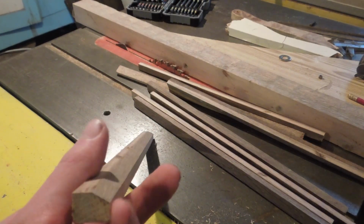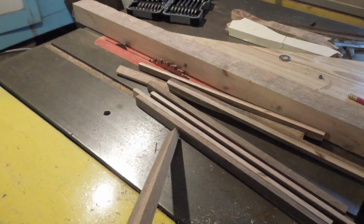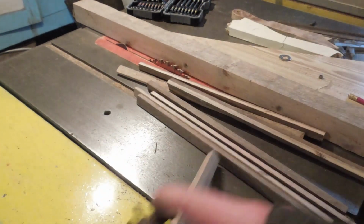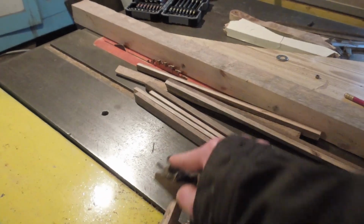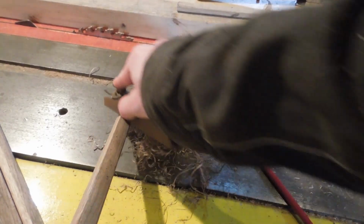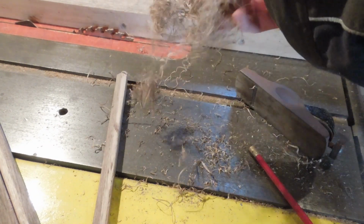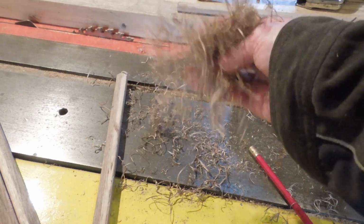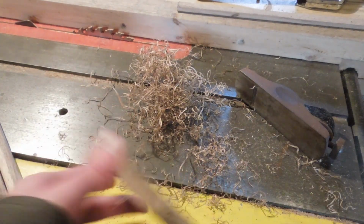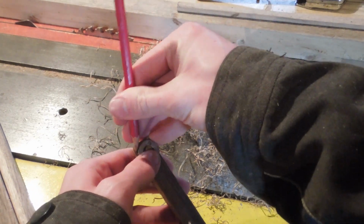All the guides are cut out and they have nice sharp edges, which isn't actually nice because it's supposed to be smooth running drawers. So block plane round over the edges just slightly, and that'll make them run just that bit smoother. And afterwards I'm left with all these lovely shavings, which are just fun to play with. But anyway, on the end I also need to round the end, and I just have a wee washer here and I can just draw it on.